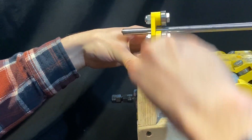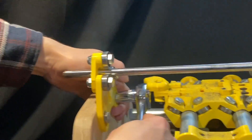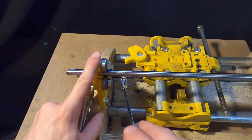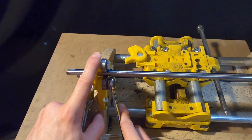Tighten the lower part of the free end support to support the round stock in place, making sure that it is adjusted evenly on both sides so the stock remains parallel with the x-axis of the machine. While holding down the top section of the free end support, tighten the two M8 bolts to secure the top bearing in place.